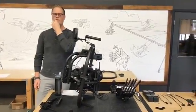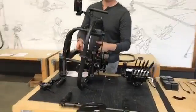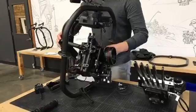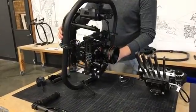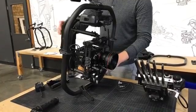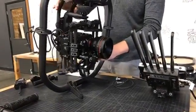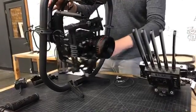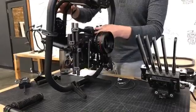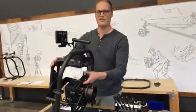Yes, the roll will. However, just to explain this visually, you will encounter gimbal lock. When you get a 90-degree roll, you're going to lose your ability to stabilize. So you have 2 axes lining up. You have pan that's stabilizing there, and then you have tilt that's also doing the same thing. So you've lost 1 degree of freedom there. So you definitely can roll through there, but you're going to lose the ability to stabilize perfectly at that singularity.